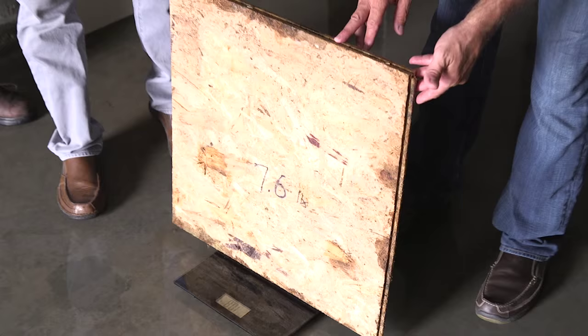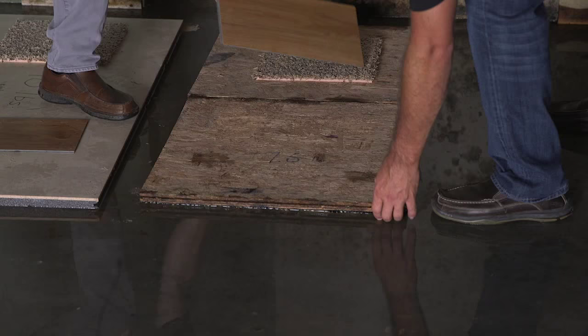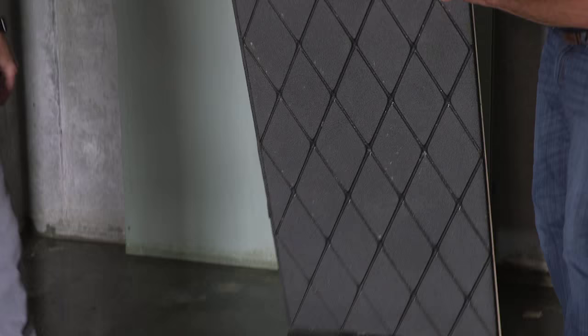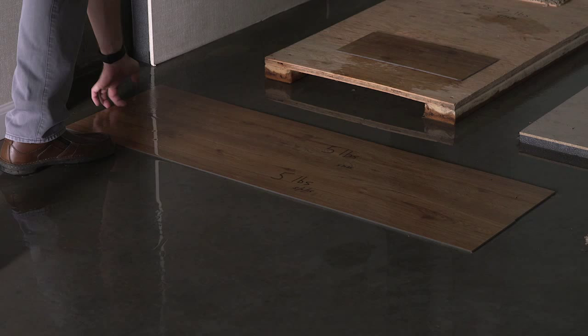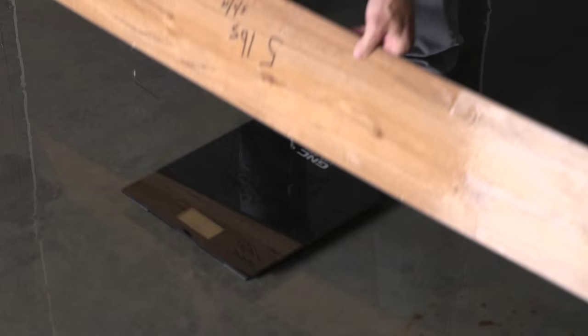We found the plastic dimples facing up to be cups for catching water from a leak. When swollen chipboard dries out, it does not return to its original dimensions. The Thermal Dry insulated floor decking, made of foam and inorganic magnesium oxide, gained very little water weight and showed no mold growth, warping, or swelling at all. The Mill Creek PVC flooring, with the wood grain look, gained no weight at all and was completely unaffected by the water.